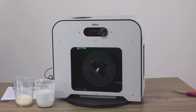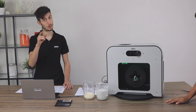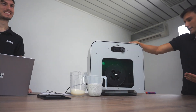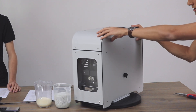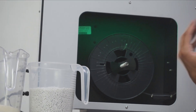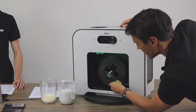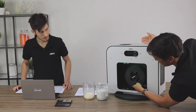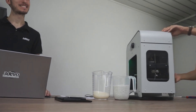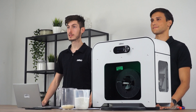There's one more important step in the spooling process: the spool must not pull on the filament. We can adjust this by turning on the tensioner on the back — the small black rotating knob — which ensures there is some slip on the spool so it doesn't stretch the filament. To check this, slightly press against the spool and it should stop. If it doesn't stop, there's not enough slip, so turn the knob a few turns anti-clockwise until you can simply stop the spool by pressing against it.